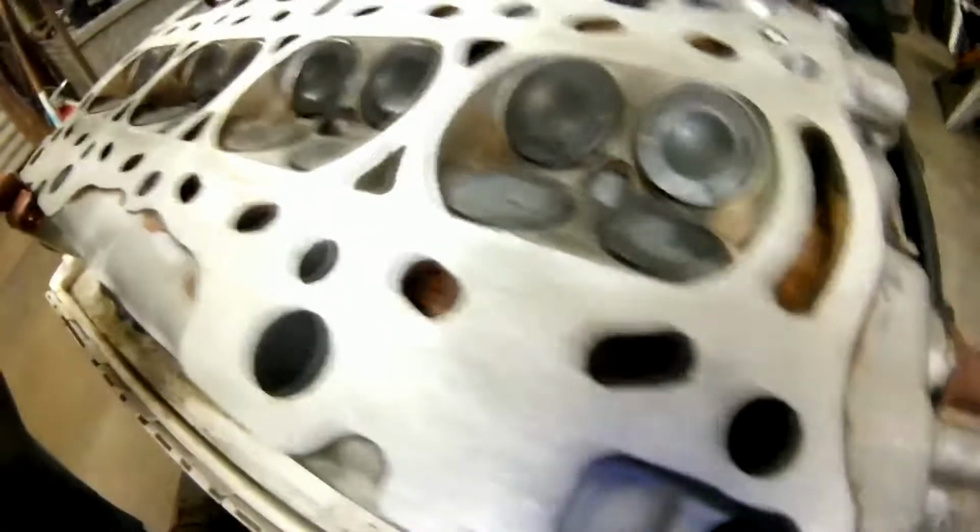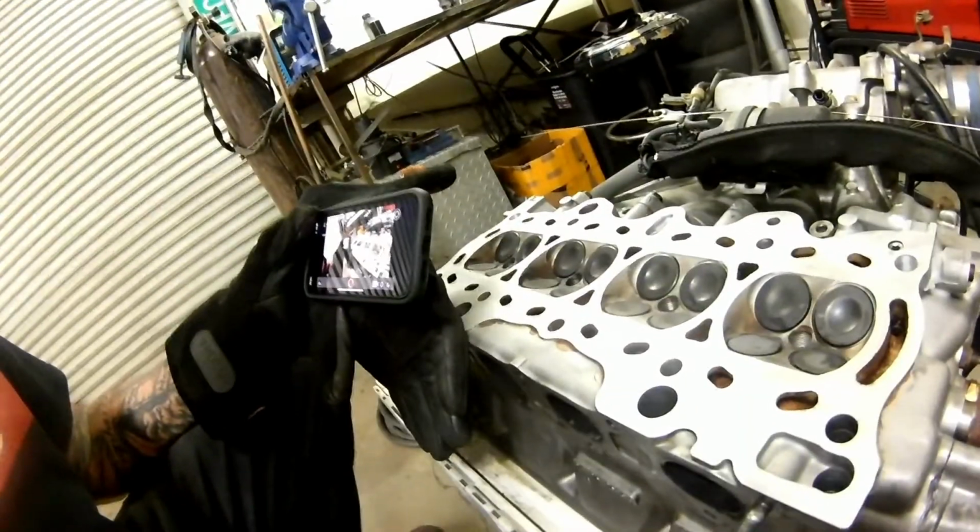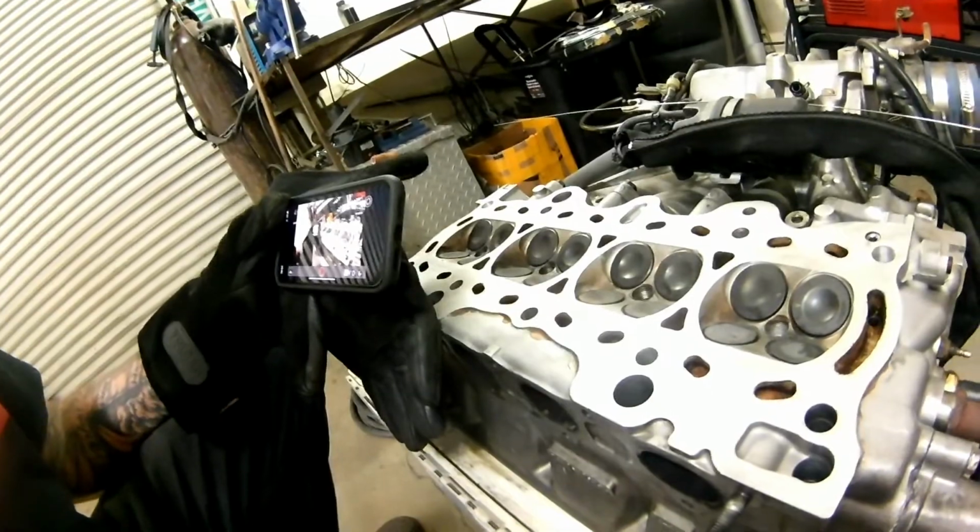Okay, so here's my conclusion to what's happening here. There's a gouge in this thing, and I'm not too excited about it. It's right there on the fire ring, if you can see it. It's very, very small, but I have a feeling that that's going to cause an issue with getting compression into the cooling system. So I'm going to try and dab some aluminum in there and see if I can get this thing to seal better, because I would rather take that chance and have it right than not do anything at all and take that risk.